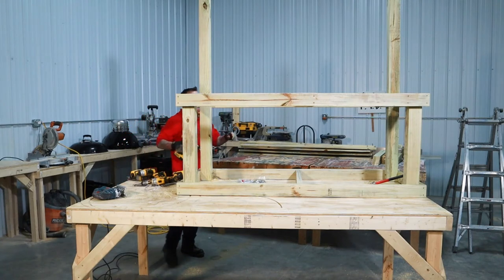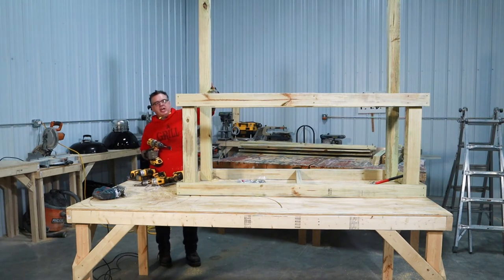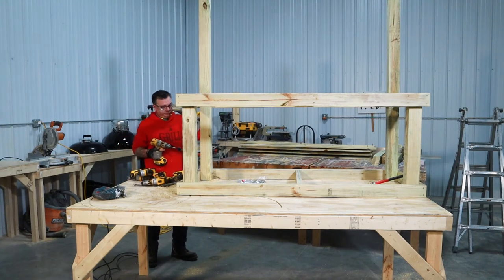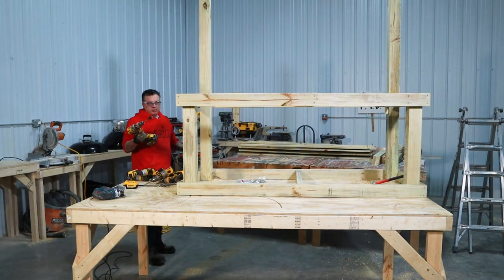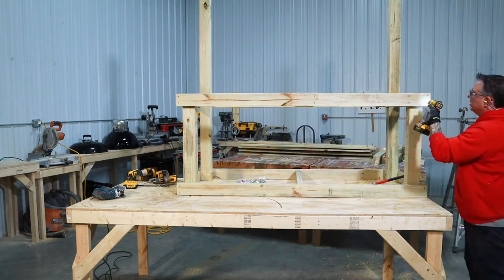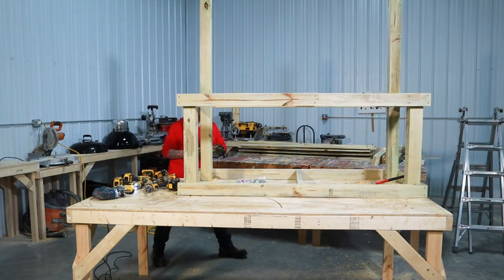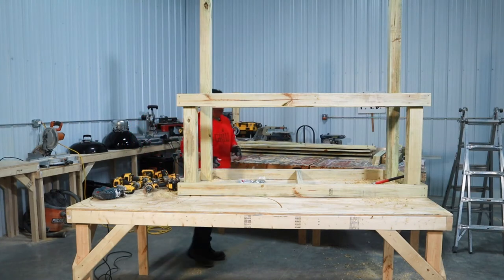All right. Now, up there, I have another 2x4 on the inside of the 4x4, so I'm gonna bore that out with the spade bit so that my carriage bolts will be long enough. Pro tip, when drilling through wet wood, get a bigger battery. All right, I think I got it drilled out. That was fun.